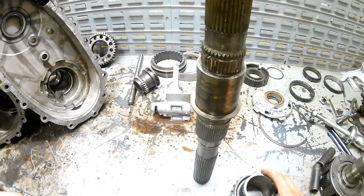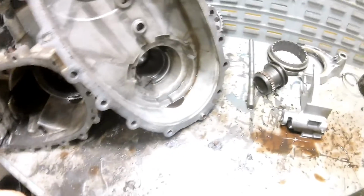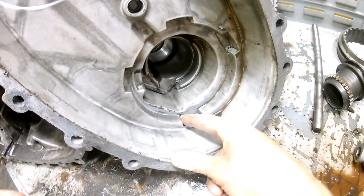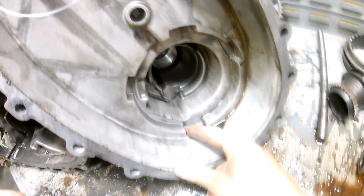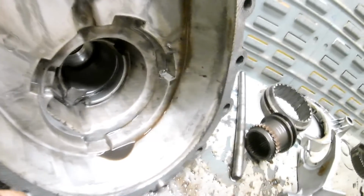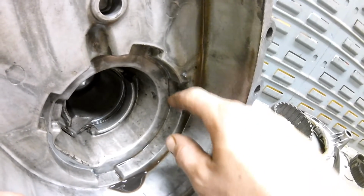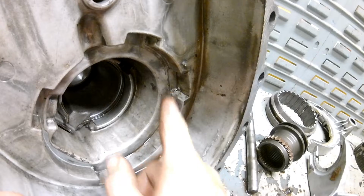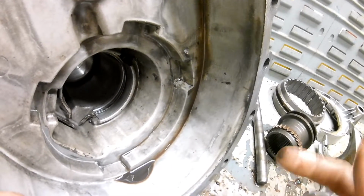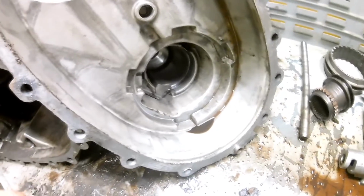And on a side note, to show you quick here, I seen this on this transfer case. Someone actually fixed the rub problem with JB Weld. I've not seen anybody do that yet. And you can see there too, there's actually a fingerprint in this one. But it rubbed into the JB Weld a little bit because they didn't do the update plate. But it held. That was not the cause of failure of this transfer case.